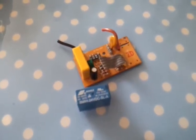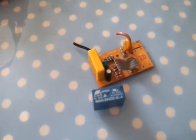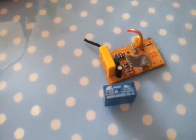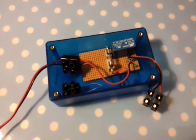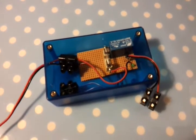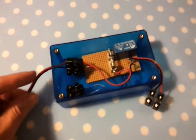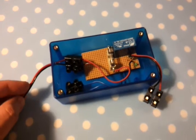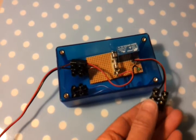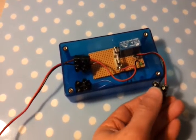It has a 24-volt coil relay that will switch up to 16 amps AC or DC, so that's ideal. Here's the finished article — this is the interface to the inverter. What you have here is a battery lead that goes to the pack positive and negative, and then this connector goes to the alarm output, the open collector output on the cell log.